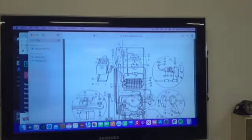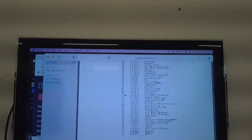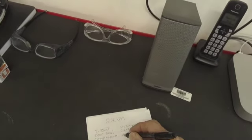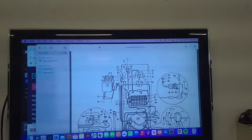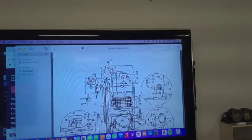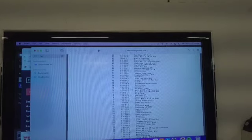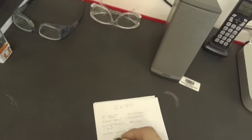Compressor. It's number 102. 311. Oh, it's an AE 1360. AE 1360. That's a Tecumseh number. What else are we going to need here? Evaporator Fan Motor is number 91. 420-0170. That's still a good number. I actually don't even have that on here. Evap motor.